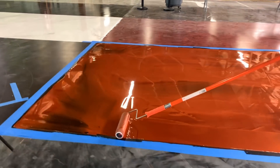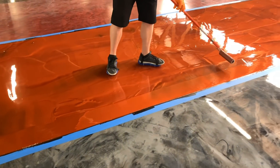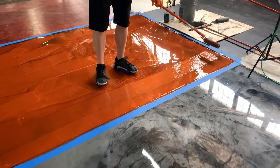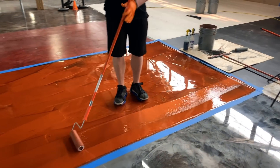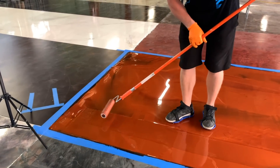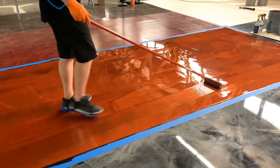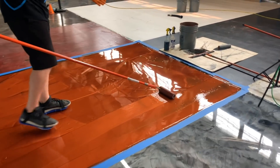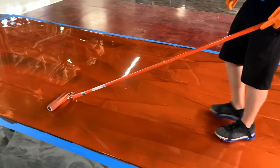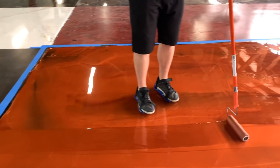It kind of takes a minute to just get into the groove of things. When your roller starts to get really saturated, it'll start pushing piles every once in a while to the edge. So what we do is, before you get to the edge, we like to pick it up and then roll back into the floor. I notice the edges are a little bit thinner, but notice how I'm starting to push a pile now — so I lift it up and see how there's a little pile. That's why I start at the end and bring that pile back in towards the middle. Then I kind of glide over to the next area, pick it up, and bring that back towards the middle. I just don't want to push it underneath the wall or off the floor onto tape.